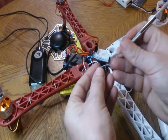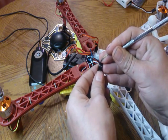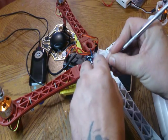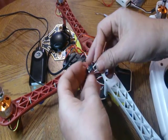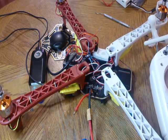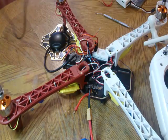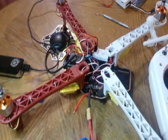I have safely done this by leaving the red wire in — there is a diode in it that protects the unit. So remove the power wire, make sure it doesn't short out on anything, and plug it back into motor port 1, or output 1. Once that's plugged back in, you want to get a long enough USB cable to reach your computer, or get a power brick or power adapter. It doesn't matter how you power your APM. I'm going to use a brick with a USB cable.